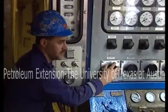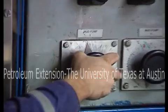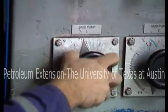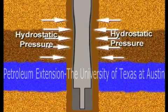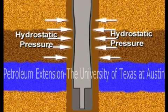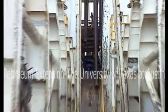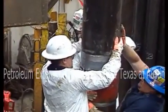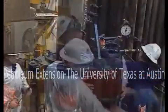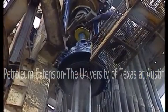Usually you fill every joint of casing with mud — how often you fill depends on downhole pressure. Downhole hydrostatic pressure can collapse empty casing. You repeat these steps until all the casing is made up and full of mud. Then you're ready to cement the casing into place, and once the cement sets, you're ready to begin drilling again.